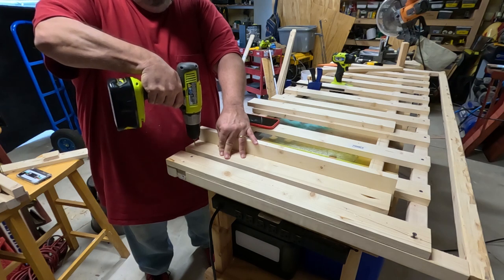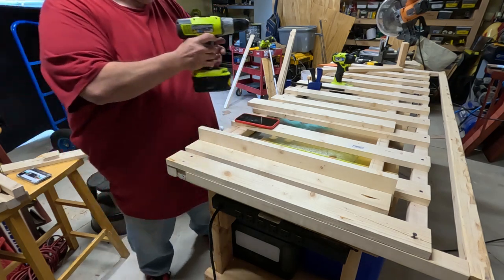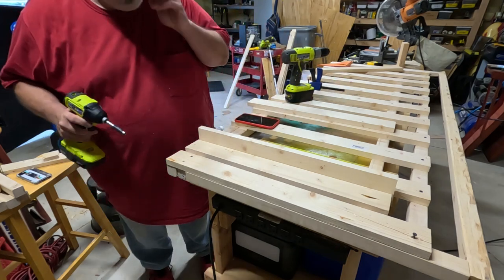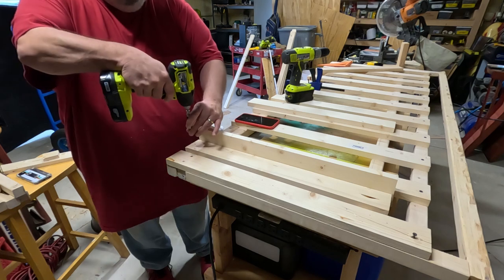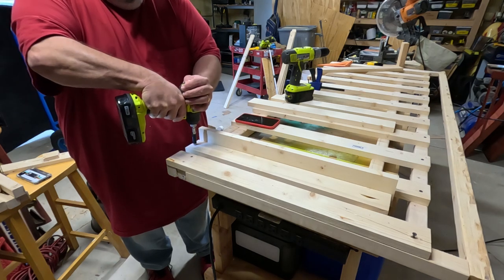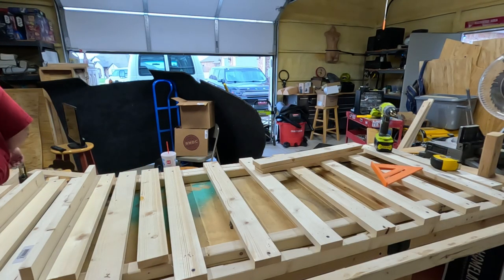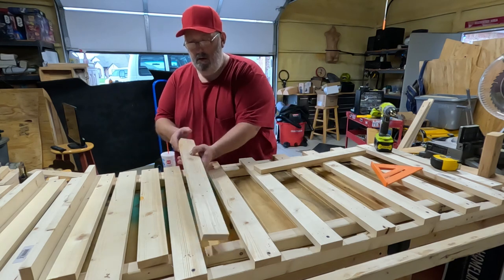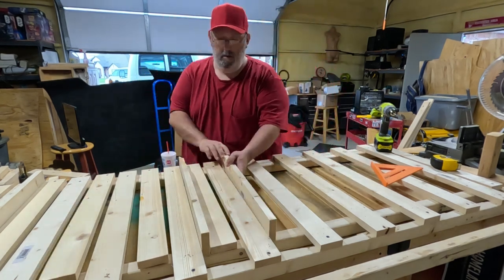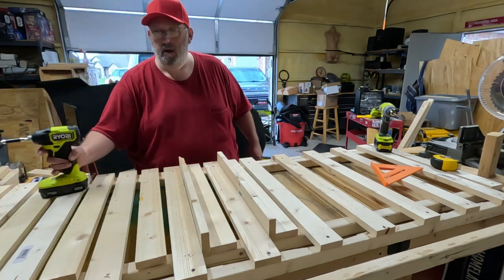With all the stationary slats screwed into place, now it's time to start attaching the sliding slats. Again, I've attached the 2x2 to the front of the frame, and the slats will attach to that, and another piece that will keep everything from sliding that I haven't added in yet. Once you get a system down, things start going pretty quickly. Again, I was using one slat sideways as a spacer so that all the slats would be parallel and equally distanced from each other.